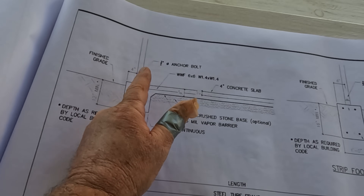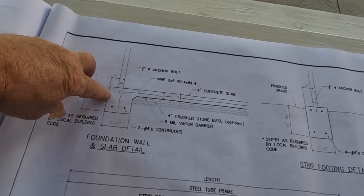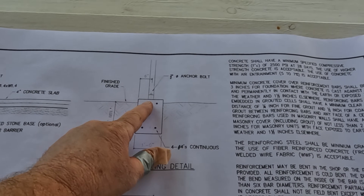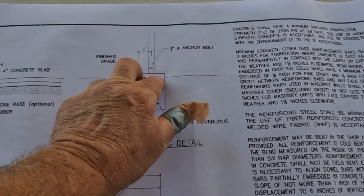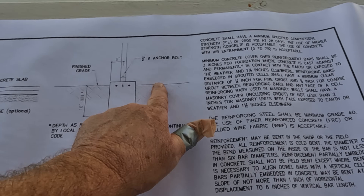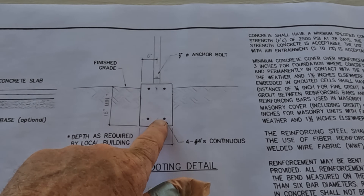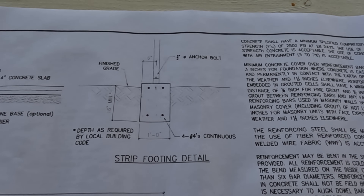I don't like this system so I didn't build it this way — to me it looks like all the water coming down the side of the building is going to be trapped in there. Here's another way it can be done: strip footings rather than a continuous slab all the way across the interior. They actually want 16 inches wide on this detail with more rebar — two top, two bottom — 16 and 12 inches wide, no slab. This would just be gravel in the interior of the building with a strip footing all the way around. It costs less because you have less concrete — just a 12 by 16 inch all the way around the perimeter, then backfill the middle with gravel.